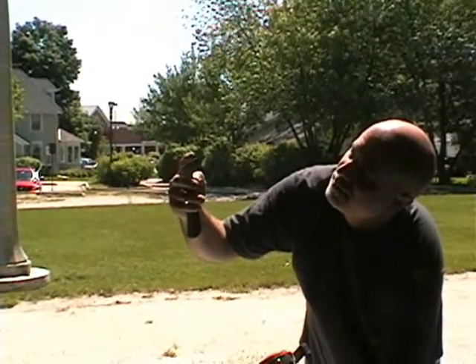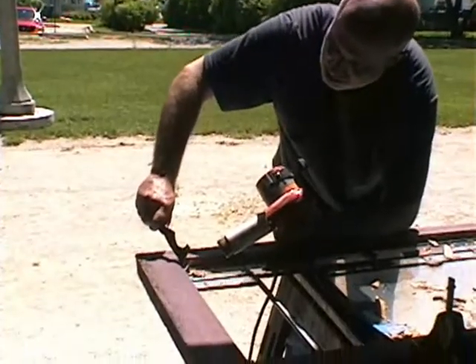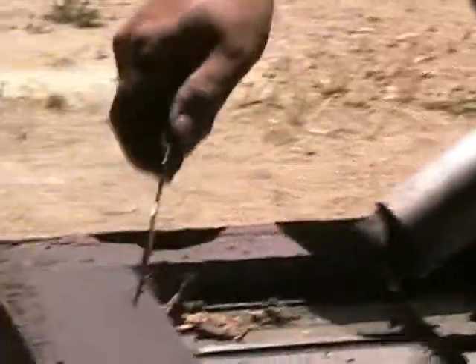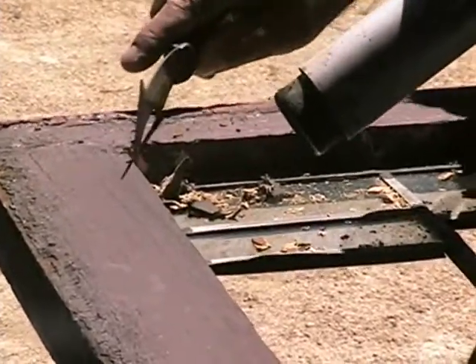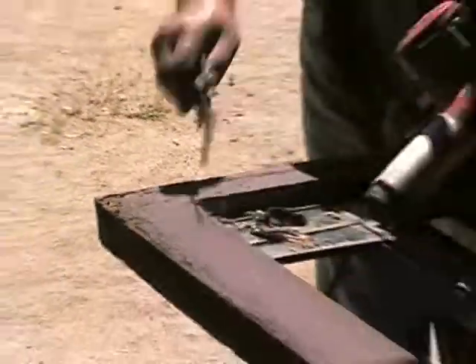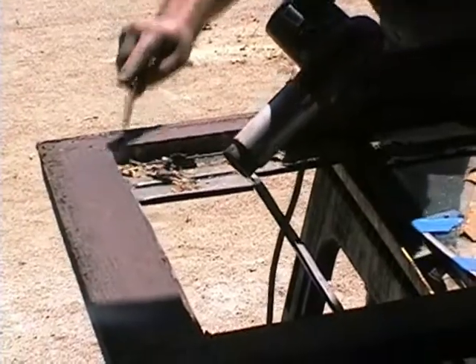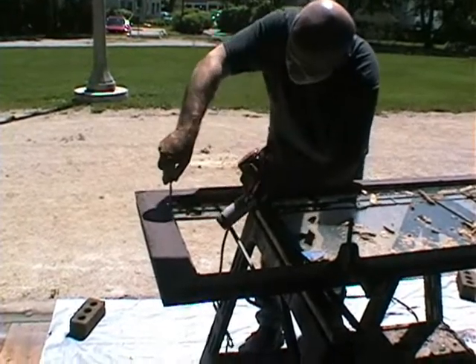I'm going to come around here with my — it's called a window tool. I use this a lot. It's got your regular edge here, and it's also got on this point an edge on the back side. So if I need to get into a corner like this, I can pull back on it and I've got a good edge coming that way too — it's kind of a combination of a pull scraper and a push scraper. This bottom rail on a window always takes the most weather, and this has been re-puttied probably several times.